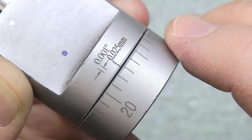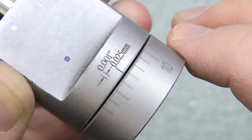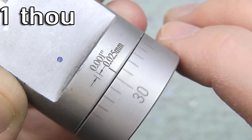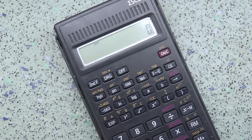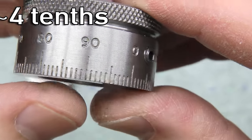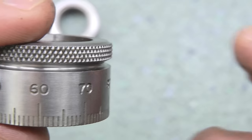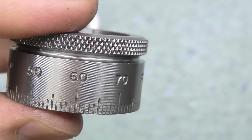I had two issues. First, the graduated dial on the metric cross slide has 40 divisions of 0.025mm, which means just about every cut that I take needs a calculator to figure out how many divisions are needed to get down to a particular size. I won some graduated rings on eBay years ago but I've only just got around to using them. These have 100 divisions which conveniently equate to 0.01mm per line on my 1mm pitch lead screw. I'm well aware that expecting less than half a thou accuracy on a mini lathe is pushing my luck, but at least I can do the numbers in my head.